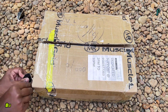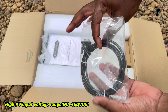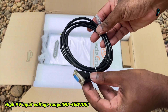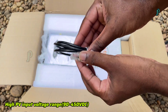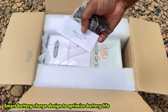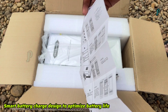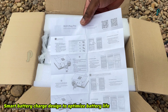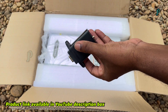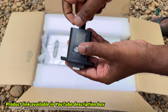Solar energy is provided directly in the box: hybrid inverter, Wi-Fi dongle, manual. Brand: MuscleGrid India. Model number: 3 kilowatts true off-grid heavy duty triple MPPT, 3200 VA. Backup time: 12 hours. Load options: air conditioner, submersible pump, all household loads. Type: pure sine wave inverter. Model name: 4.8 kVA battery-less, supports LiFePO4 battery. Android and iPhone monitoring. 24V mode, triple MPPT. Efficiency: 98%, output voltage: 240V, output frequency: 50Hz, output power: 3000W, changeover time: 10 milliseconds, surge rating: 3000 VA.